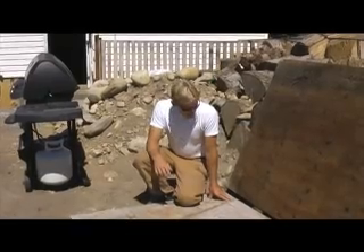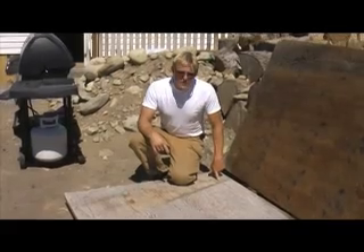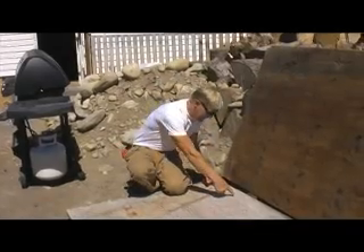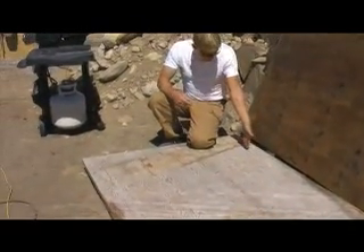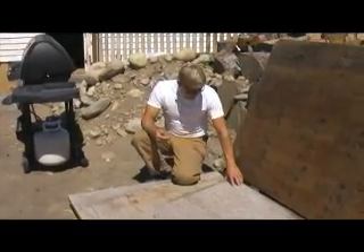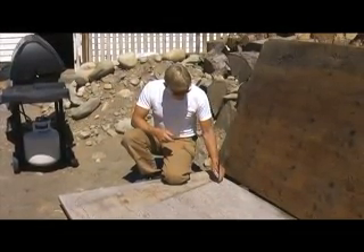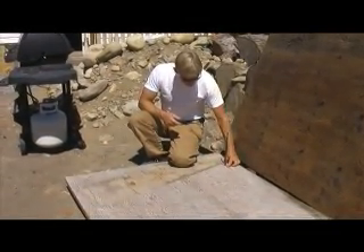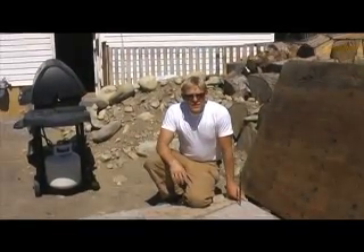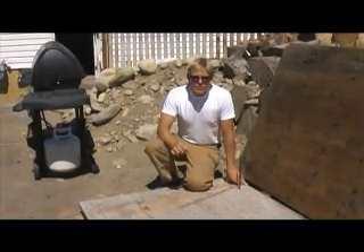The reason I didn't push the saw blade all the way through both sheets is because you create quite a long cut on the one sheet. You could do it that way, but I don't want to cut through too much material. You end up with a long cut seam where your concrete is going to be pushing from behind. You don't want too much excess room on either side of where your tie physically fits through — just a small portion for this tie to go through. I've cut through just far enough on the first sheet to mark the second sheet, which tells me exactly where to do my saw cuts.